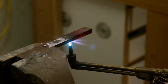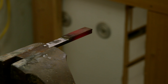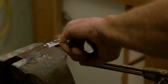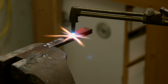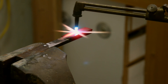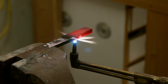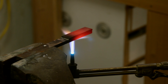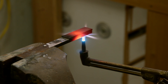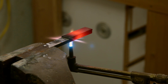If you'll notice — I hope you can see it in the video — you can see how the bottom here is starting to turn red. The top is also starting to heat up. You can see I left a little bit of silver solder coming out the back side, and you can see how as it's getting hot it's getting ready to melt. It's not melted yet. If we were to stop right now, this would not stick together. It's also a good time to check and make sure everything's all good and square right where you want it, because pretty soon you won't be able to adjust it anymore.